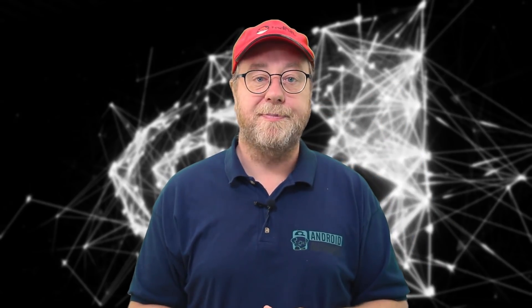The way I got around that was giving it a static IP address, so I always know what address to connect to. It's also worth mentioning there is a little script that runs on the JetBot that tries to update that display. If the display is not there, it gets itself into a bit of a spin, so I had to deactivate that service because it was using up a lot of CPU time.